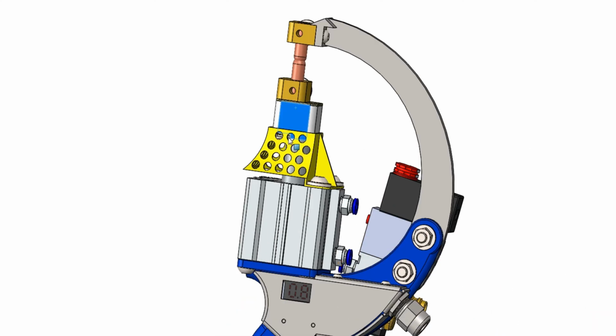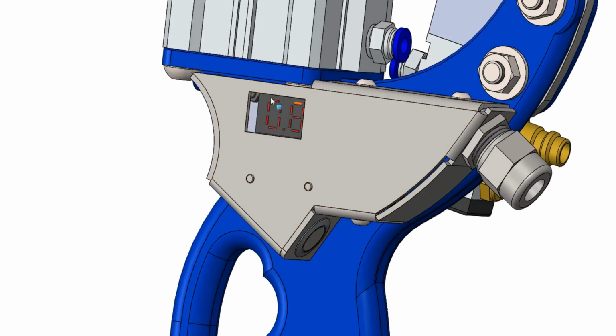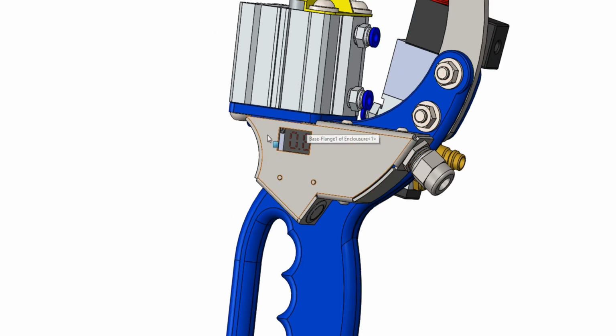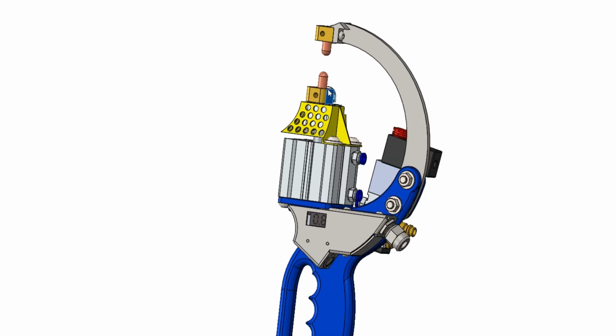When the electrodes come out, I'll start from the beginning. This switch starts this timer, and the timer doesn't latch for one second, and the piston comes out and in like this when you push the button to allow you to line the device up where you're looking to weld. The device won't weld when the contacts touch each other. They still won't weld if you keep releasing the trigger within one second. You get used to it. It's actually quite a long time, one second, when you're doing this. The device doesn't weld until you hold the button longer than one second.